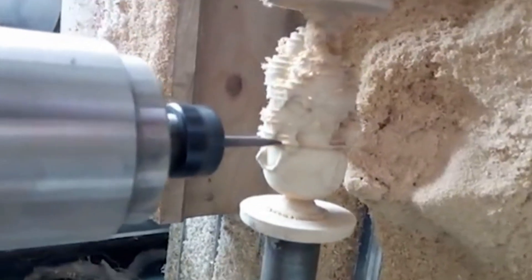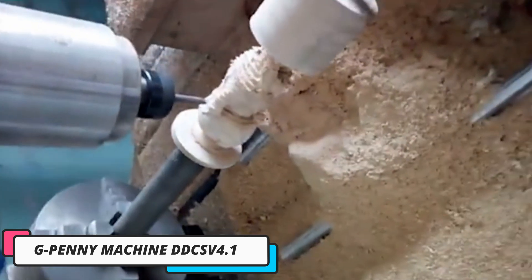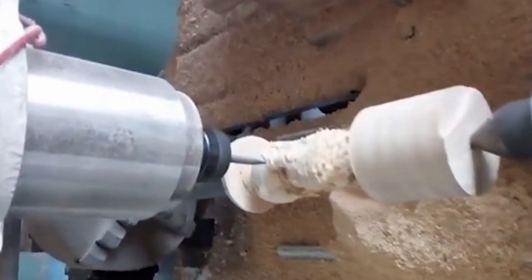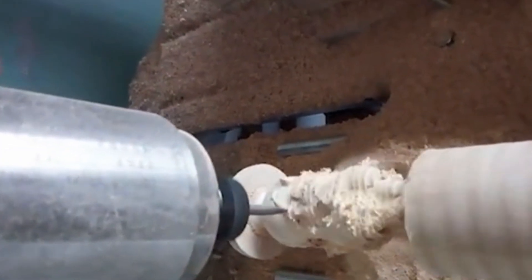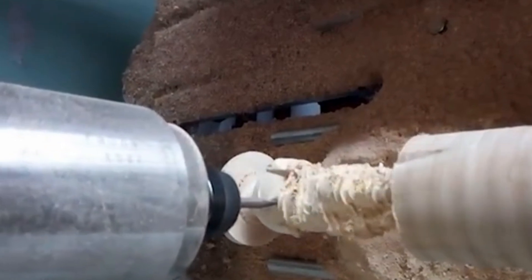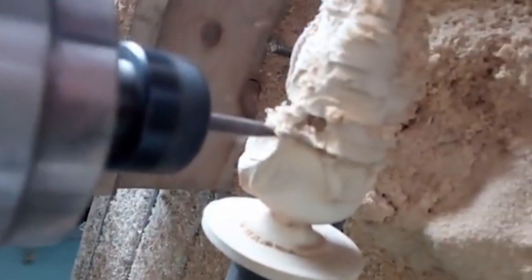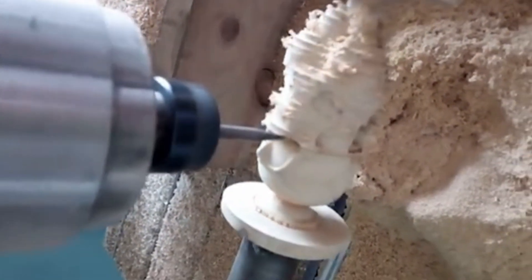Number 3: G-Penny Machine DDCSV4.1. The G-Penny Machine DDCSV4.1 is a versatile CNC offline controller ideal for various CNC machining applications. It supports both 3-axis and 4-axis control, offering a pulse output of 500kHz for fast and accurate movement control. The ARM9 chip at its core ensures reliable and stable performance, balancing power and efficiency.